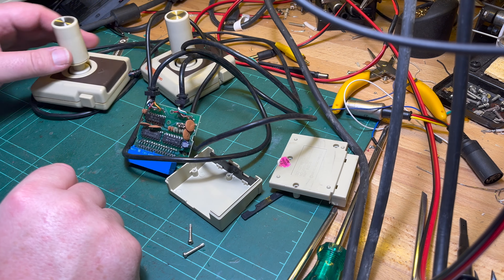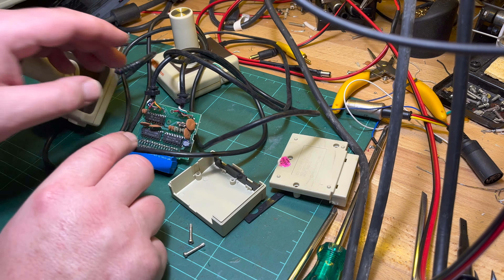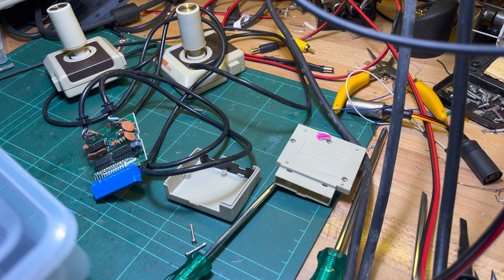Back to looking at these joysticks. Ben reckons the address decoder might be interfering with the SD card or flooding the bus or something. That's this 74LS138 here - it's a 3-to-8 decoder. So desolder it and try a new one. I could even socket it as well. Let's see if I can find my spare, then we'll suck it off and just try a new one.